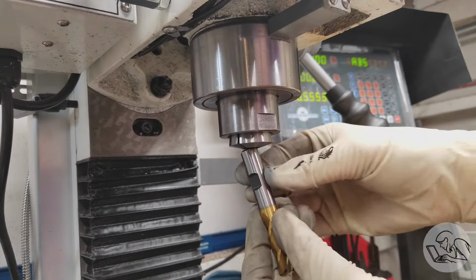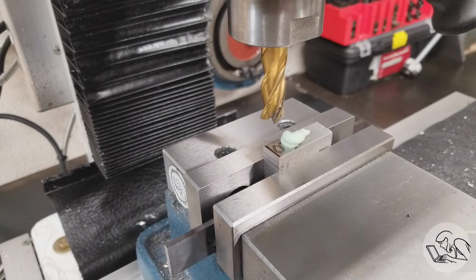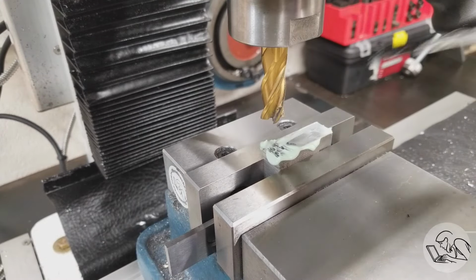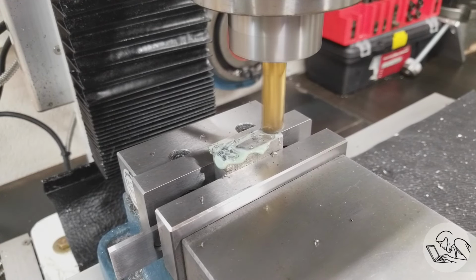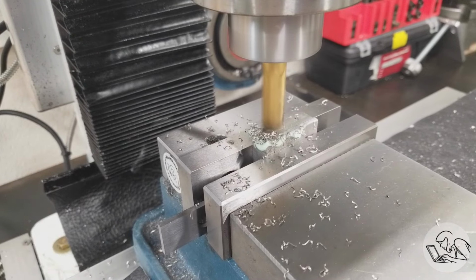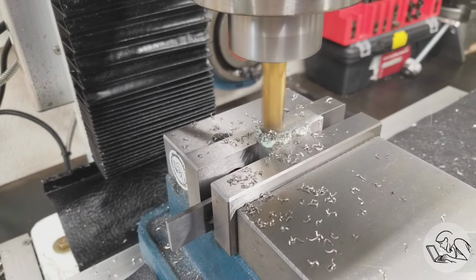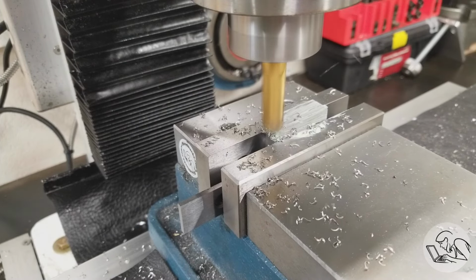So I'm going to set it up in the mill, and I'm going to square it up. Okay, get some machinist toothpaste on there and give this a shot. Now I'm only going to be machining 4 of the 6 sides of this stock, because the nominal dimension of the stock in one axis is actually the same as I want for my final part, and the thing doesn't have to be machined all the way around, so I'm going to leave it rough and I'll just clean it up later on the buffing wheel.